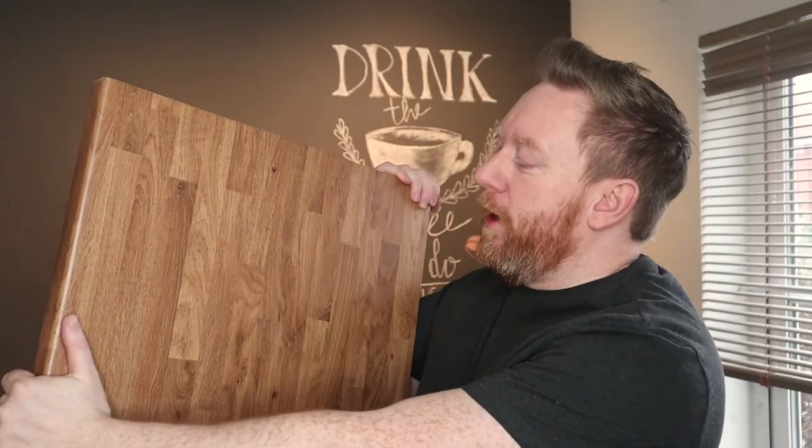The worktop has now been cut to size — 171 centimetres and 6 millimetres long, so it's going to be a pretty snug fit. I'm expecting it to chip the paint and scrape the walls a bit as we put it in, but I'd rather have a nice tight fit than gaps around the edge. We can easily paint over any marks anyway. It came out pretty well for a first time using a circular saw — lots of measuring, double measuring, and measuring again. You can never measure enough. The edging came out really clean, which saves money as we don't need to buy beading to cover chips. Let's get it onto the battens.